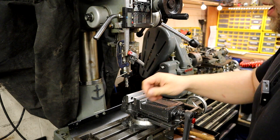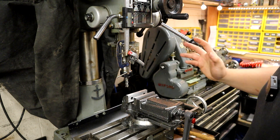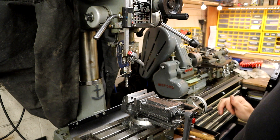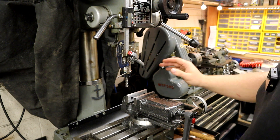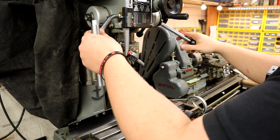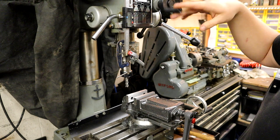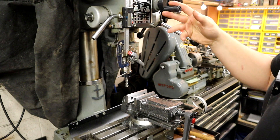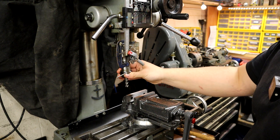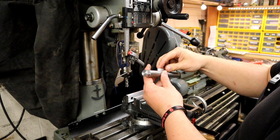You're only ever going to be machining really light cuts on here - it's a mickey mouse milling machine, let's be right about that. The problem I've been getting is a lot of vibration - this is probably a 20-25 year old machine now. When you're clamping this down and it's engaged into the fine feed, there's a lot of play within this wheel, and it's creating a few misdirections in the actual z-height of your keyway cut.